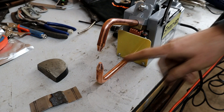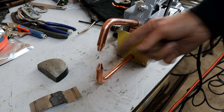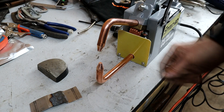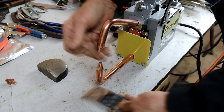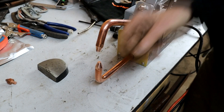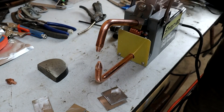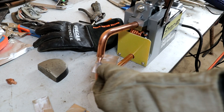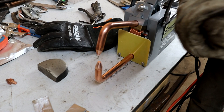Just to follow on a few days later — I ordered some new tips. The original ones that came with it seemed a little unreliable; I wasn't getting consistent results. These new ones were about $19 US-made, from Amazon. I'm assuming they're better quality. I've been playing around with them and they do seem to be getting a nicer spot weld — taking time to dress them nicely and get the surface contact right. Let's try just over two seconds, which is what I've been finding works nicely.